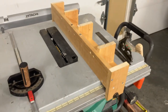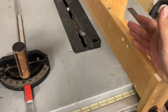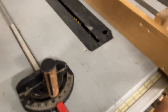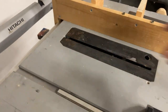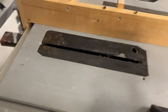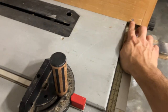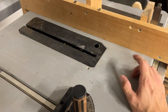The first thing I did was make an L-shape: this piece on the bottom and this upstanding portion that rides on the table. I just screwed those together, lining them up as best I could to make sure they were square. I put a screw in the corner and cut them to length — from this slide rail all the way over to the other slide rail. I pre-drilled and countersunk everything, using about an inch-and-a-half wood screws throughout.